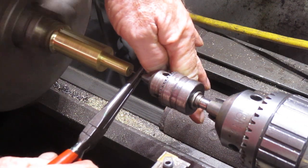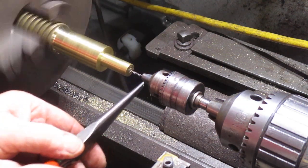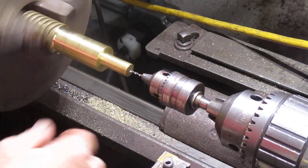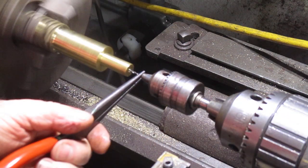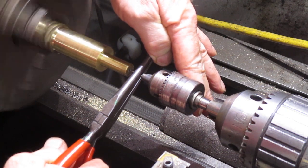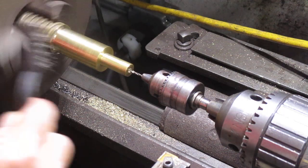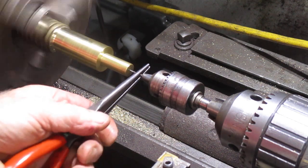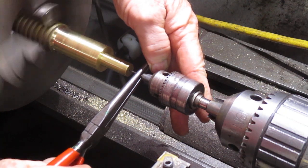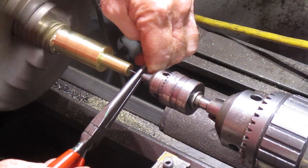This thing is kind of acting like a clutch — I don't want to break that drill bit off in there, so it might be just as well I'm doing it this way. Because as soon as that drill bit gets chip-bound, it spins on this pair of pliers. You can see the chips coming off — pretty small. Clean it all off and run it back in. I only got another inch to go. That's chip-bound again, so this is actually probably working pretty good as a clutch. This is without a doubt the hardest hole I've ever drilled.